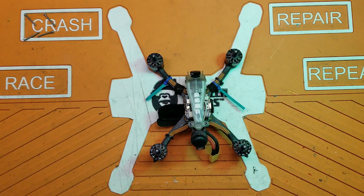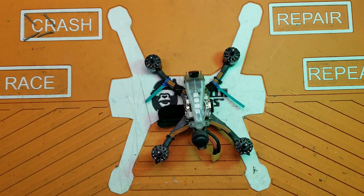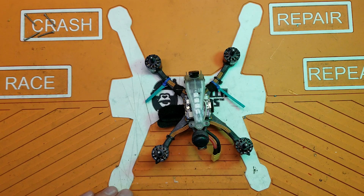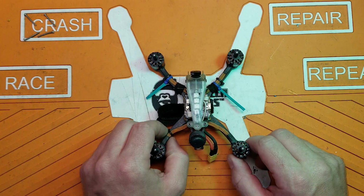And, you know, I reached out to Diatone after I've basically built up a really good Betaflight 4.0 tune, and they said that's impossible. They don't leave the factory without a tune. This thing left the factory without a tune. Didn't have any of the ports set up, didn't have a good tune on it. It just wasn't right. So they sent me the hex file that should have come on this, Betaflight 3.5 blah blah blah, and they sent me the CLI dump. I put that on there and it flew way better.